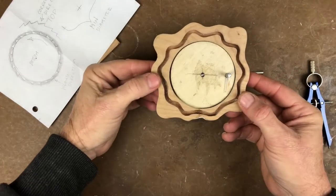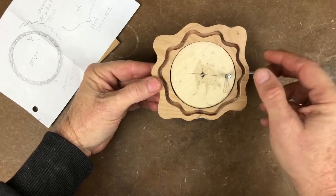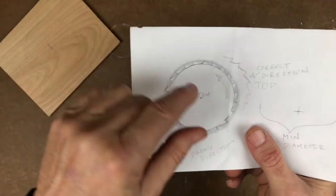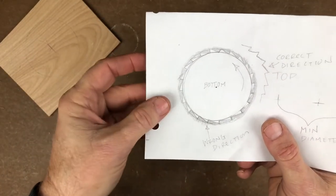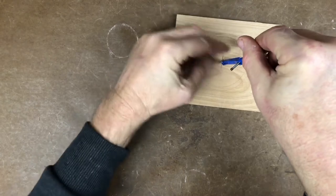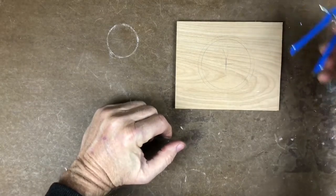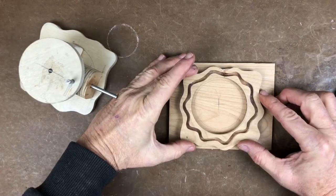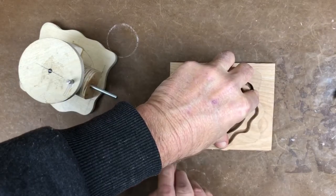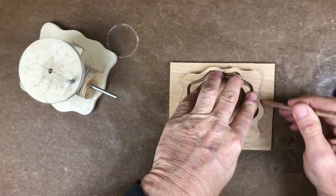Instead, we're going to make a much finer geared, much more regular toothed little wheel and we'll get on that project right now. What I'm designing here is the inner diameter. Now I'm going to draw the ratchet teeth on there and then we're going to cut them out. I am going to reuse the shape — I can lay that on there and use it as a template. Saves me a lot of time and at least I get some use out of this first attempt.